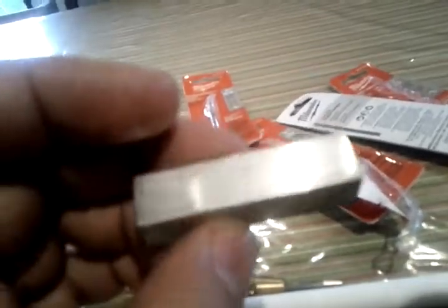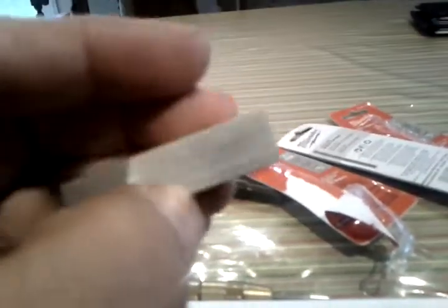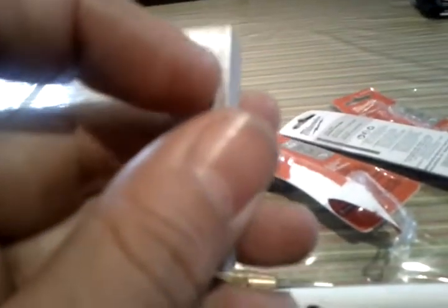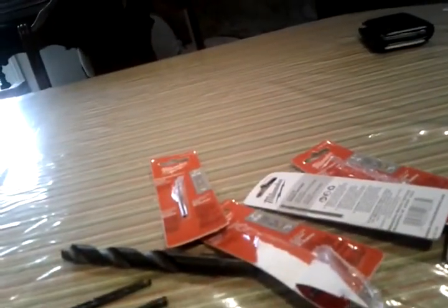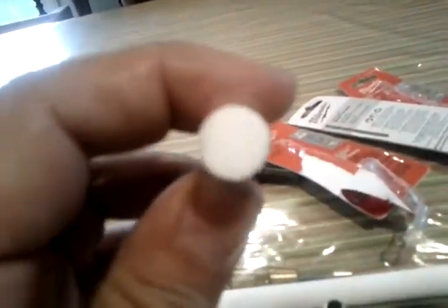We have our aluminum bar, and this one's probably about half as long as I need it to be. So we're going to cut it down to about an inch, or 20 to 25 millimeters, and we'll drill a nice big hole through it to insert our brass coupling into. We'll drill a three millimeter, three and a half millimeter hole through the PTFE.